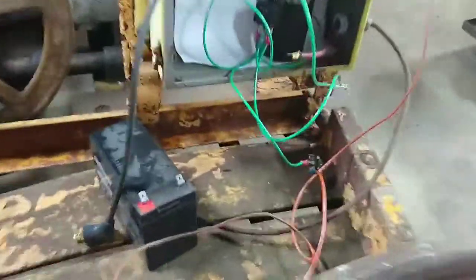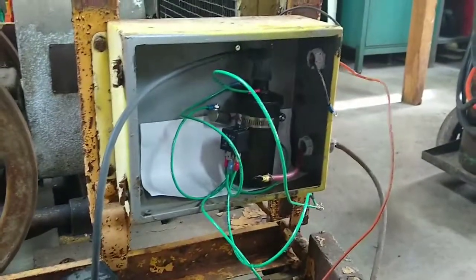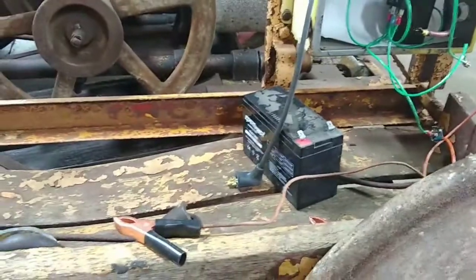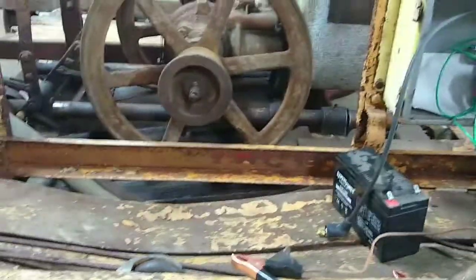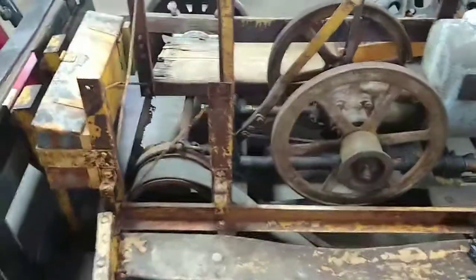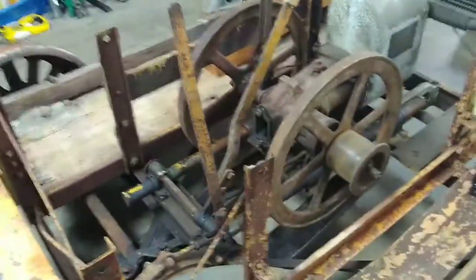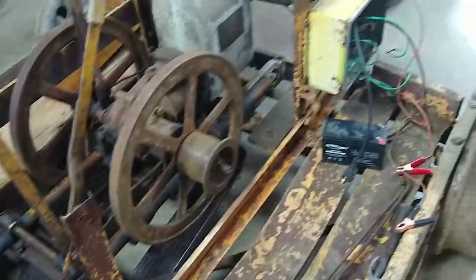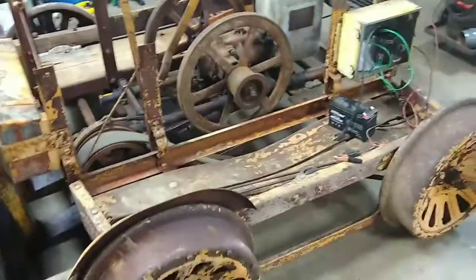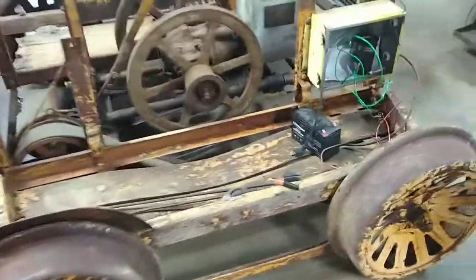Got a buzz coil here put together. Tested how it works. So right now, currently just trying to get the carburetor parts rebuilt, remanufacture a few pieces, repair that ignition system, and then we'll do a temporary wire up and see if we get the motor to do a little putt, if anything. But I figured I'd get some video of what she looks like now.